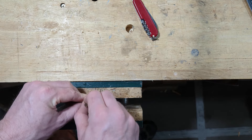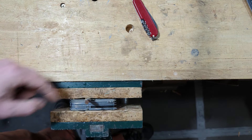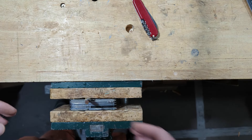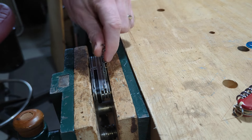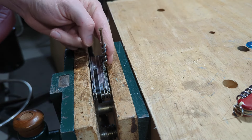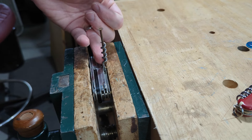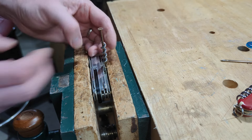If you just start moving it while holding it in your hand and you're not squeezing the knife, you can actually loosen up the peening that holds everything together — and you don't want your knife to get all loose. So the vise is going to hold it all together while you do some bending. The vise is holding the knife firmly and we're ready to try a little bending. Don't bend it the wrong way — I need to go this way. Put the nail all the way in. The nail is to keep the corkscrew itself from bending, giving it just enough support so as you put pressure on it, you don't end up making the corkscrew crooked. You want to keep the corkscrew as straight as possible; the bending needs to happen down in the little shaft section — that's usually where things get bent.